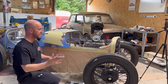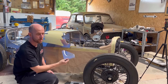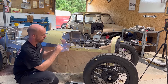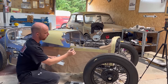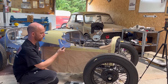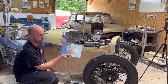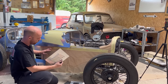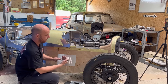I've taken this panel as far as I can take it now — all I've got to do is put this swage on. I've been setting that up at work, actually — just setting up the tool. I've come up with a nice setting on the swage tool and I'm really happy with it. I'll do a close-up so you can visually see it. That is going to follow this whole line all the way around the bonnet aperture — the bonnet will sit in there nicely. I've also been stamping out some louver pressings, and I'm going to wheel this panel up now and I'd like to incorporate the louvers into that panel.